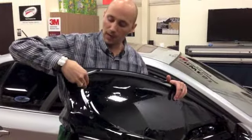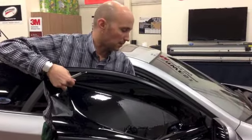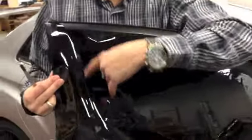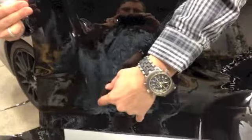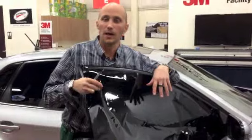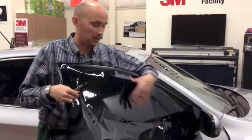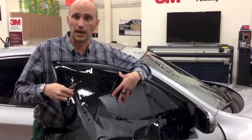From that point in time, once you're happy with your top border, I can go ahead, fold this back, roll it up, and I can actually even use a grease pencil to mark my sides and my bottom depending on where I want my final cuts to be. Then go ahead, take my templates off to the glass table, take a straight edge around my corners, and I'm good to go. I've never really touched a blade to the actual glass.